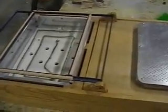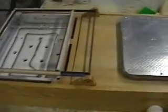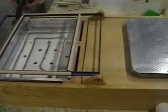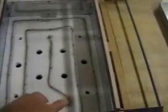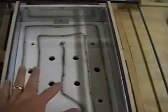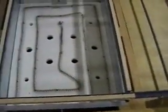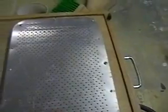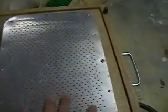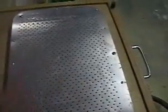I know you've probably seen vacuum forming before, but I'm going to go over my setup anyway. I bought this vacuum forming machine from a guy at a swap shop and reworked it. Here's the heating element — it had a big grill to keep stuff from hitting it, but I found I needed to let my ABS get a little warmer and sink a little deeper than the grid, so I removed that. He also had a setup with a piece of mesh, a piece of aluminum, then a piece of wire and another piece on top, and with the shop vac I just couldn't pull the suction needed, so I totally reworked it.